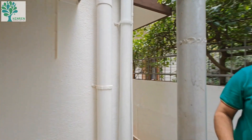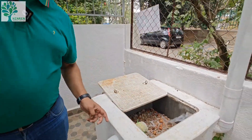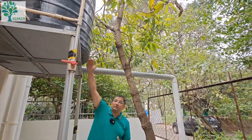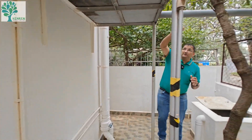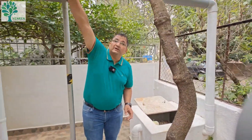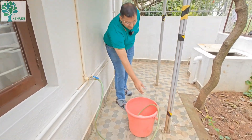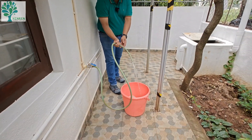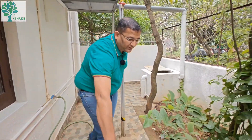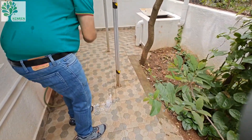The water, before going into the filtration tank, first goes into this sedimentation tank. This is provided because if there's some contamination — any silt or anything — it settles down here first, then a second time here. The overflow from this gets into the filtration tank. This water from the sedimentation tank is used for non-potable use, like gardening or floor swabbing. Though it is clean, it is better to divert the first few minutes of water.